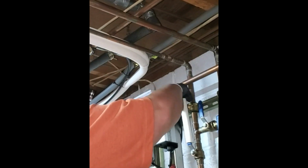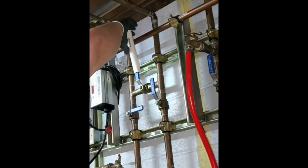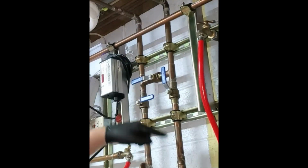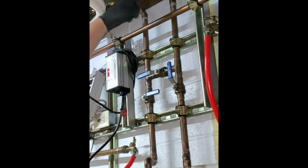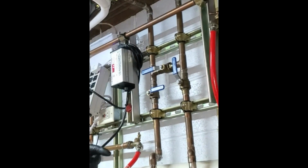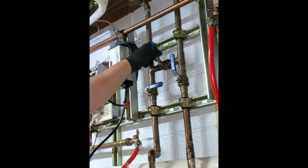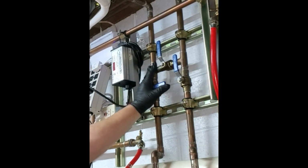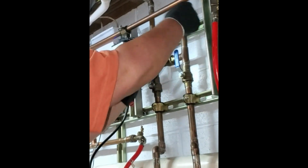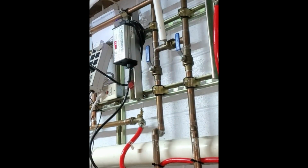Close this valve. So the kitchen sink no longer gets water, but you go, oh, you know what? Open this valve, and now the soft water comes up. That used to go up here, now it goes to both of them. So the water comes up, goes to both of them. Now you got soft water in the kitchen sink. We want to drink unsoftened water. That's just a personal choice. So we leave it like this. And this tool is just to help you, because sometimes those valves get a little sticky. And then we leave it up here for safekeeping.